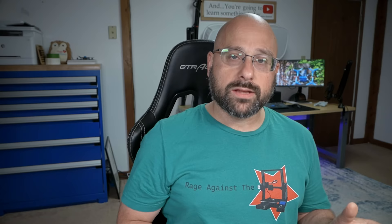The same is true for bit rate. Standard 25 megabit per second is relatively solid. 50 megabit per second is there but it feels like they're still tuning it — it is not universally believed to give better performance. And when you use 50 megabit per second you take up twice as much spectrum space, so especially if you're flying with other people you'll want to be at 25 megabits per second. You just get fewer pilots in the air at the same time with 50 megabit per second, and more probability of interference.